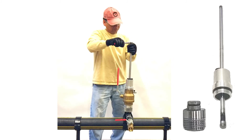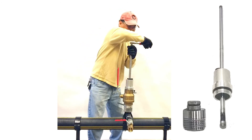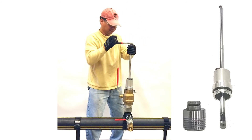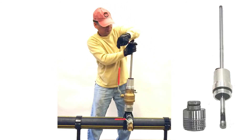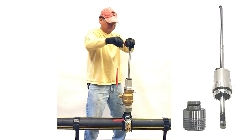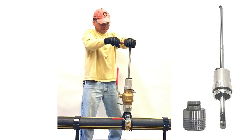Maintain downward pressure while turning clockwise. Once the leading thread engages the pipe, turn the shaft clockwise for the recommended rotations according to main size to tighten the plug. For example, 4-inch SDR 11 requires 7 revolutions. Plug tightening procedures are detailed in the instruction manual. As you're tightening, open the bleed valve to verify gas has stopped. If possible, open the service meter valve to ensure gas to the service has stopped as well. If necessary, further tighten the plug in quarter-turn increments and verify the gas has stopped.